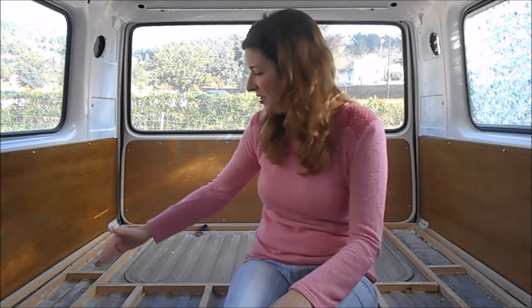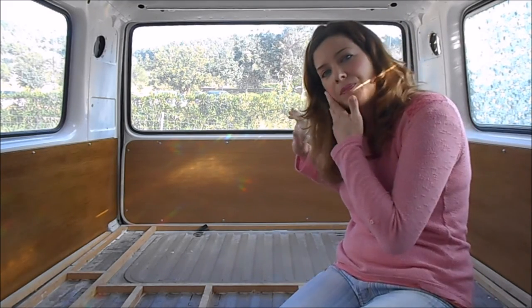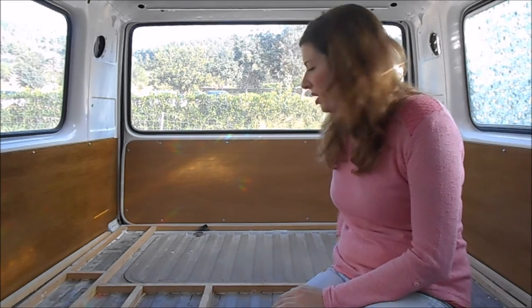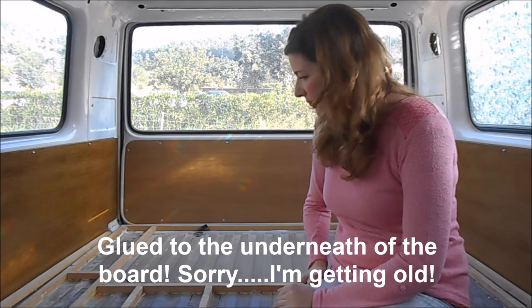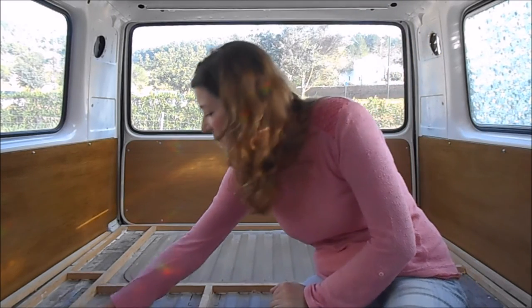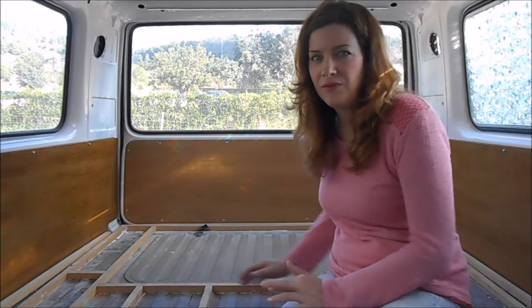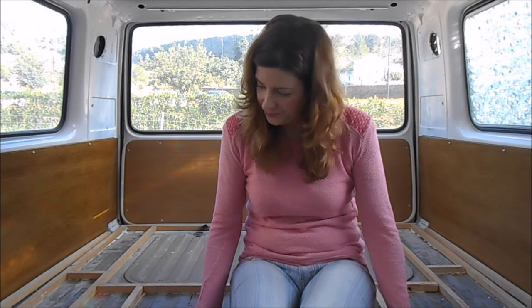Then I fitted the supports and basically just filled in - I left this section empty because of course that has to be lifted up, and that can just have a board on a hinge with sticks glued to the underneath. I fitted that there making sure it was completely parallel, then added these, and then this one making sure it was parallel to that, and just filled it in, increasing the number until I got to a point where I felt that a thin board would be strong enough and I wouldn't put my foot through it.